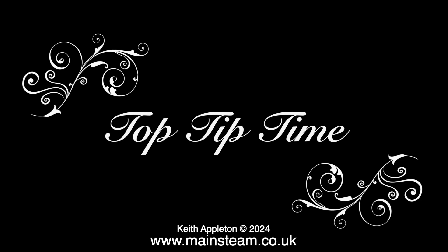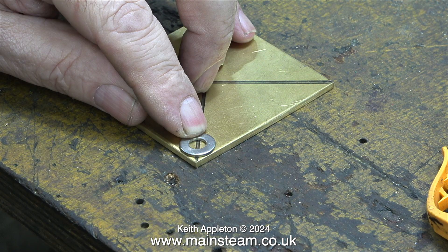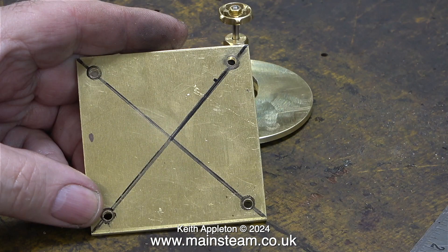While the tank is cooling, it's top-tip time. I need to drill a mounting hole in each corner of the base. What I do is draw a line between each corner, then simply hold a washer over the line and draw a circle on the inside of the washer on the lines as shown. Not perfect, but near enough for rock and roll. In the centre of each of these circles I drilled a hole 9/64ths of an inch in diameter, which is the clearance size for 4BA.